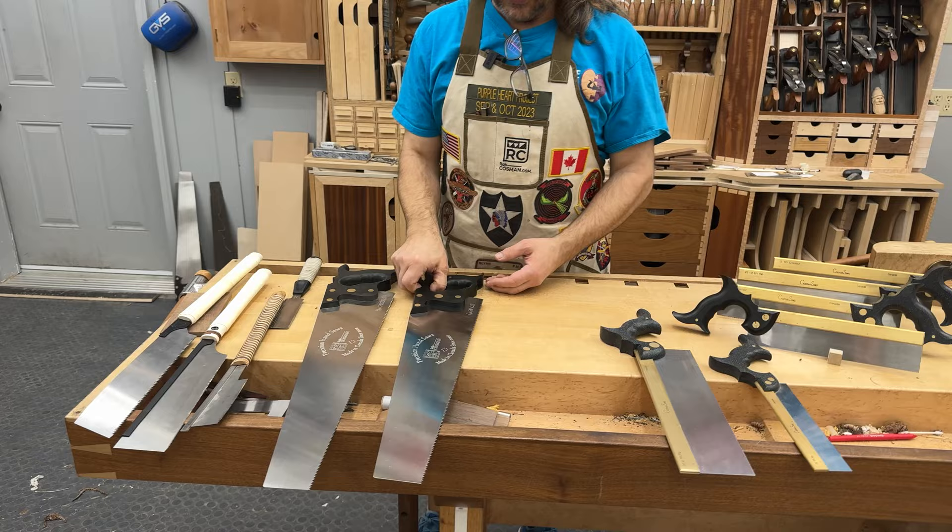Our most popular, of course, is our dovetail saw that we've been selling for the last 15 years. It's designed for drawer work — anything that's going to be a piece of house furniture where you're cutting dovetails in the drawers. It gives you an inch and five-eighths depth of cut. It's got the little starter teeth and it's really comfortable. We developed a handle so that in a dark room you'd always know where the blade is — little finger recesses carried through all of our saws, so every time you pick it up, your hand goes to the exact same position. It's a three-finger open pistol grip, putting your thumb and forefinger opposite each other for great stability.